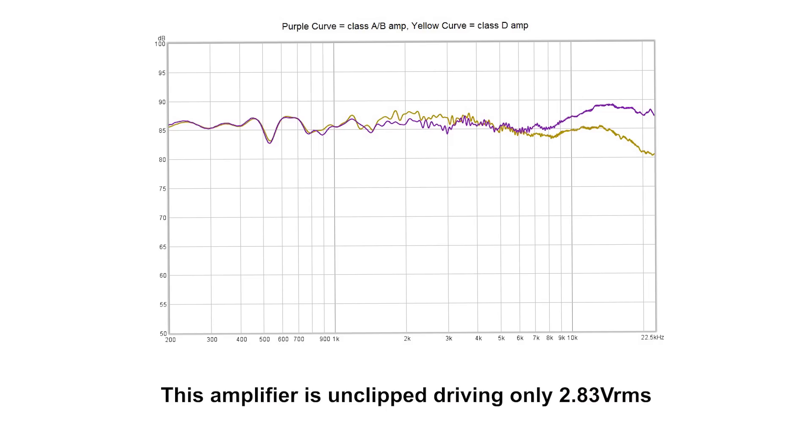So that's basically two examples where an amplifier will sound different — there's no doubt about it. You can definitely hear an audible difference from an amplifier that's 5 dB down above seven kilohertz driving a speaker. The common myth is that amplifiers all sound the same unless they're clipping. Well, here's one example where you have an amplifier that's not clipping, delivering clean power, but it's not good at driving low-impedance loads. Some of these lower-end Class D amplifiers are not load invariant, and I'm going to be talking more about this in a future video.